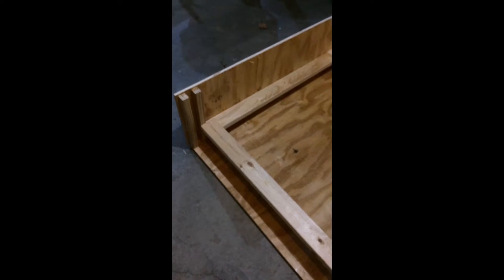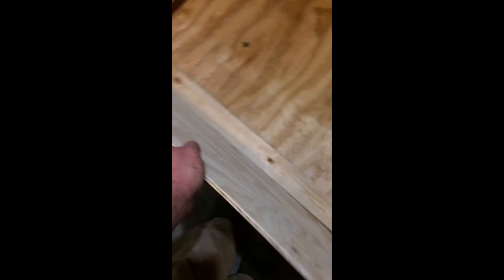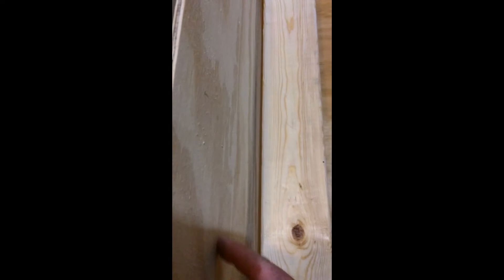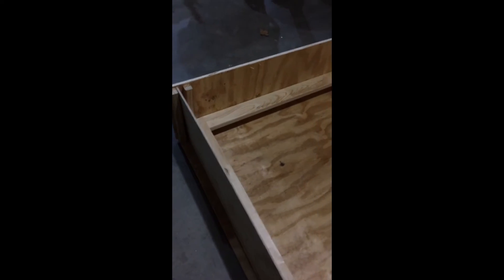The last thing to do is install the door. We'll cut a 2x4 that fits perfectly between the door opening slots, then cut a board that will fit down into our slots. Once this is done, we'll attach the door to this form so it becomes one piece and can slide in and out. Here's our completed whelping box — you can just take the door and slide it directly into place right through the slots.